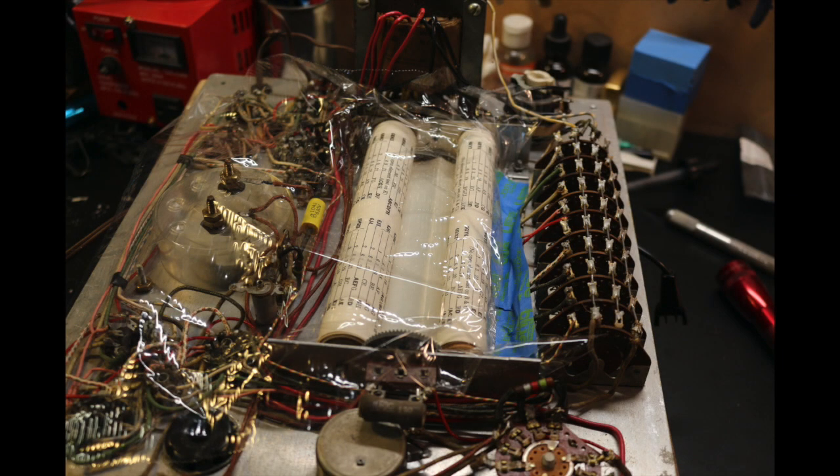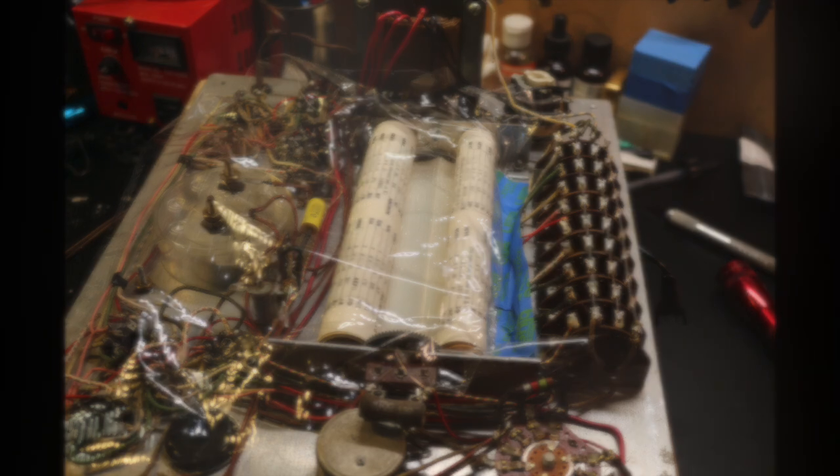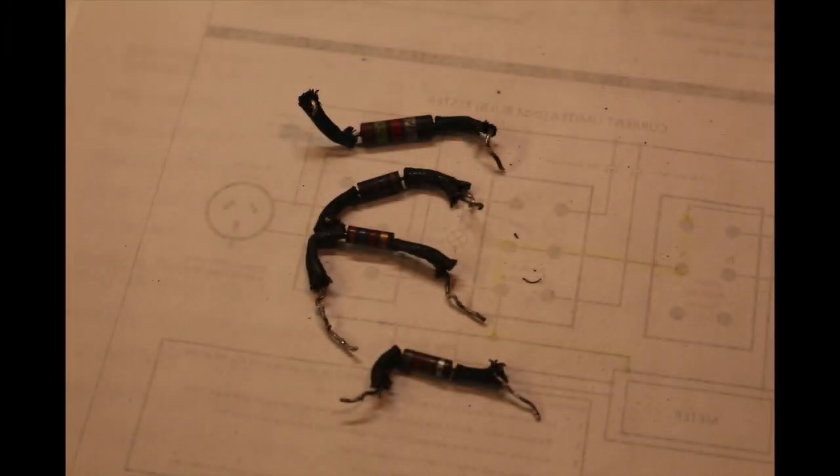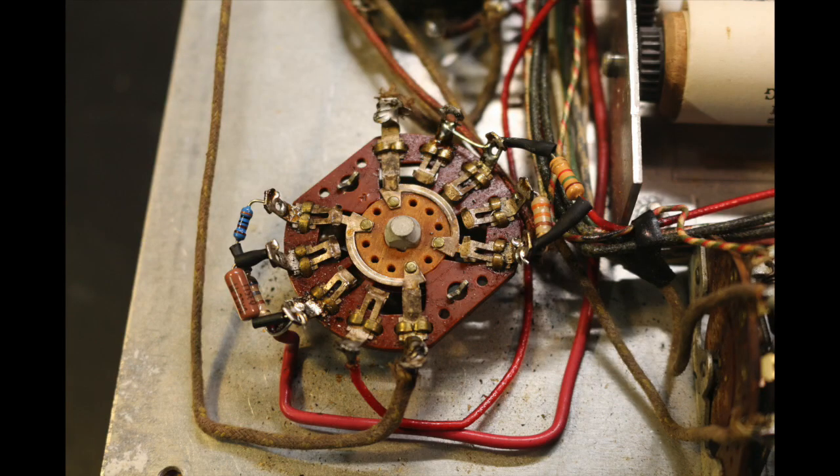I covered the scrolling paper with plastic wrap and then began cleaning those switches — that bank of switches on the right — because I really didn't want to get oil spots on the paper roll. I pulled one end of all the carbon comp resistors and measured them. They're mostly precision silver and gold band, just one or two brown bands. I measured them all, and it turns out there were four culprits — four that were not in spec — so they were replaced. It's amazing how much smaller a quarter-watt resistor is today than it used to be.